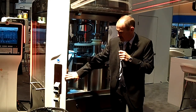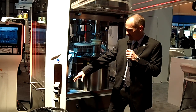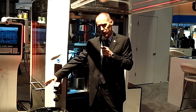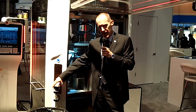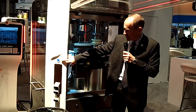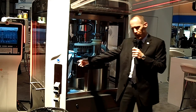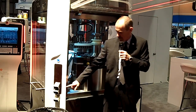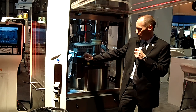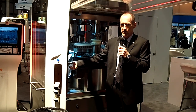As finished tablets come to the front corner of the machine, you can see that the discharge assembly comes through the corner post at a 45-degree angle. This is done such that when peripheral devices such as metal checks and de-dusters are installed outside of the press, the operator can gain access from all four sides without having to dismantle the peripheral devices and reinstall them. The discharge assembly is removed with the push of one button only. All components that come into contact with the product are stainless steel and can be easily removed and cleaned. The diverter mechanisms used for diverting quality control samples or out-of-specification tablets are mounted on eccentric cams, and they move in a way such that a continuous channel is always maintained, completely eliminating any risk of a broken or incomplete tablet making its way into the good discharge chute.